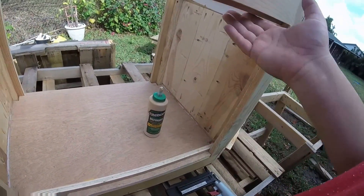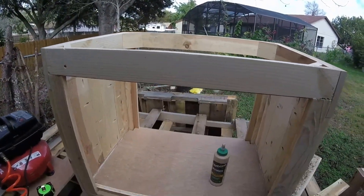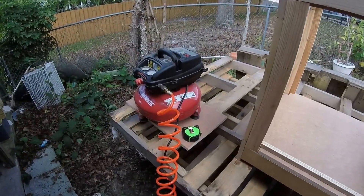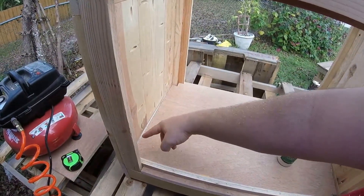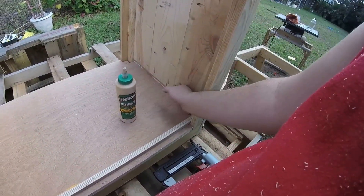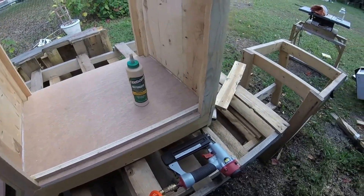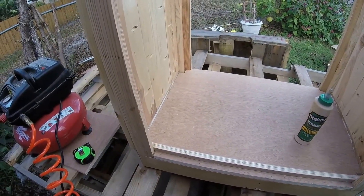For the edge banding, I'm gonna glue that and set it in place. I might fill in the bigger holes depending on how my mother-in-law feels — she's giving me carte blanche, so anything I want to do is up to me. What I'll probably do is cut a piece of 3/4 inch Luan ply with a 45-degree miter on the table saw across the bottom on both sides, so everything comes down with matching 45-degree miters — or I might just buy some quarter round trim pieces.